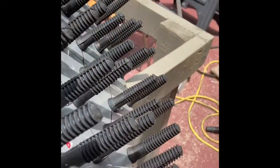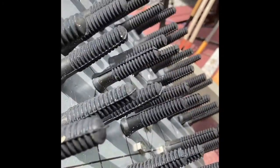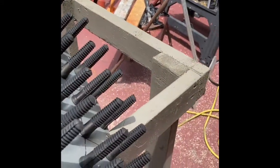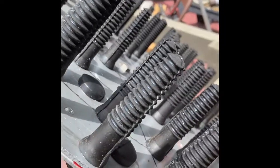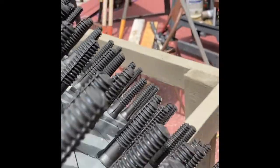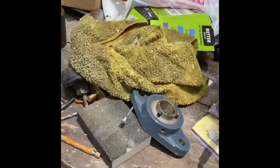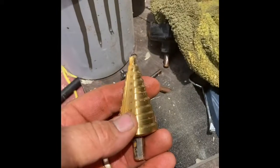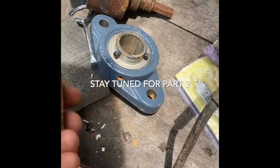The chicken fingers are three-and-a-half inches long, silicone rubber, and really good quality — very rubbery so they pull in nicely. I'll show a little tool next video for how to get them in easily. For the three-quarter-inch chamfered holes, you use a step bit — something like these from Harbor Freight, about $15 for two. Set it to three-quarter inch and you're good.